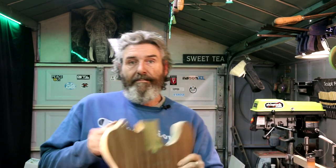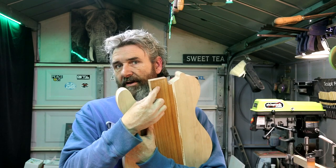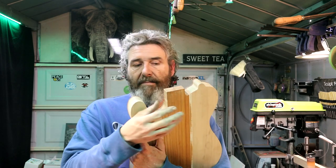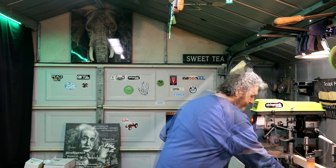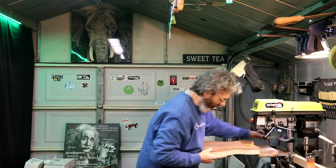Because we marked up on the inside of our neck pocket, and I know I've got tons of sanding plus I'm going to drill recesses in the back, I'm not concerned if we get just a little tear-out — but we want to go slow, and I will use a backer board. That looks good — let's drill it. And there's four.